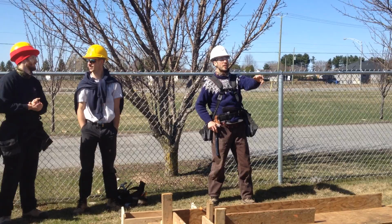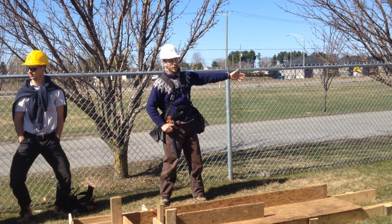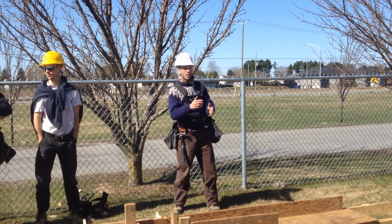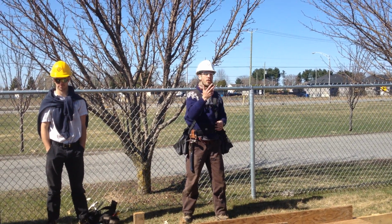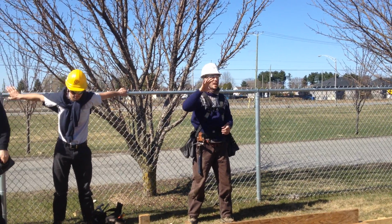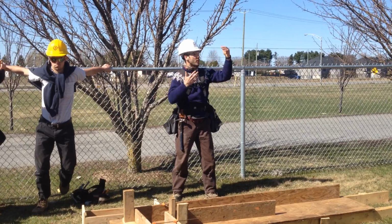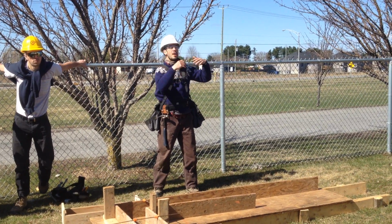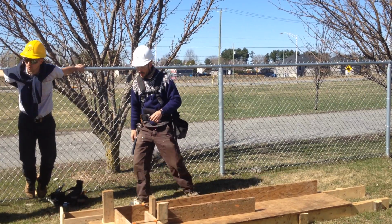Because before you do the inside, we'll do the pilaster. We have to continue the wall another 8 foot, and then we have to lay out our rods like we did in the classroom. Then we'll consider the inside wall, but before that we're going to put a pour line, a bulkhead, a window buck, you know? So we're not there. We still have whalers to put, we still have kicks, so your outside wall is not completed right now. So we'll see how we can complete this right after.